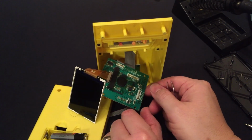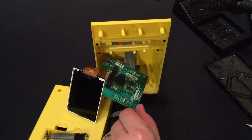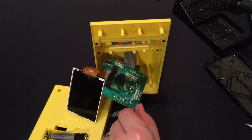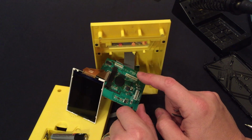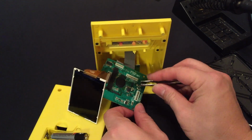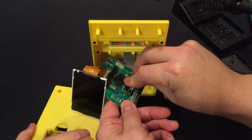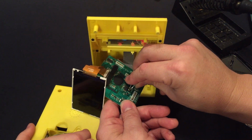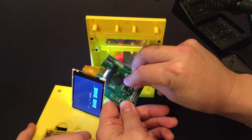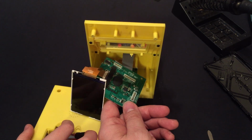All right, guys. So we stumbled upon something interesting. Earlier we removed this jumper and we were able to get Rolling Thunder, Galaga, and Mappy, as well as Pac Man. So with the jumper in, we noticed this. Get it on there. Okay, go ahead. All right. Galaxian. All right. Then the other set of jumpers. Go ahead. And Dig Dug. Yep. All right, so that gives us Pac Man, Rolling Thunder, Galaga, Mappy, Galaxian, and Dig Dug.